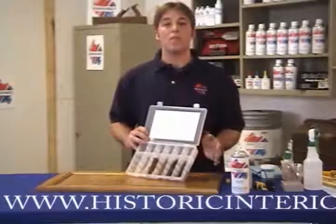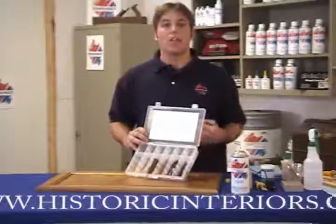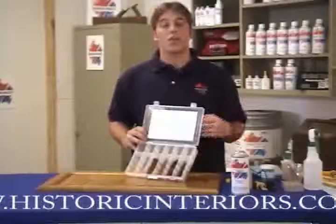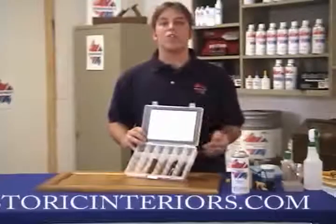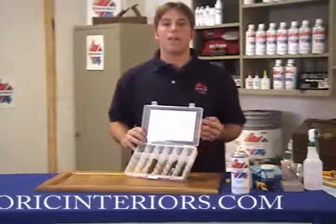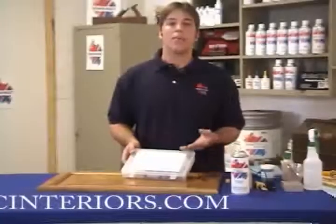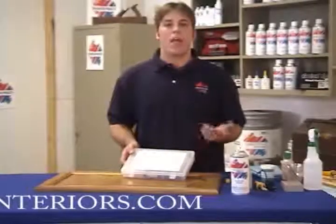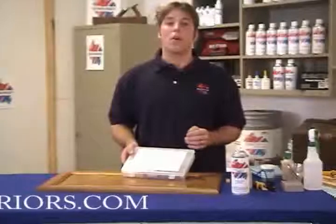You do have an unlimited amount of working time. When the shellac stick gets hot, it melts into a liquid, and you can cool the stick with a little bit of water and bring it back into a solid, and you can do this several times. Suitable places for a burn-in are a tabletop, a cabinet door or a drawer. Antiques are always a great place for a burn-in, and my favorite are elevator walls.